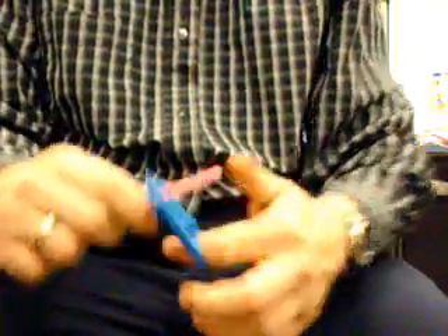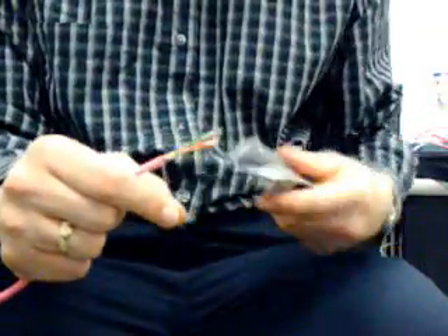Today we're going to make an Ethernet straight-through cable using Cat5 enhanced unshielded twisted pair wire. Strip your wire about an inch and a half to two inches down to give you enough room to play with the wires. Get rid of the little silky braiding that's in there because it gets in your way when you're trying to manipulate the wires.